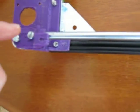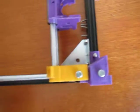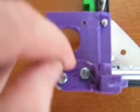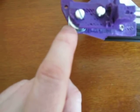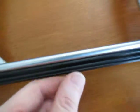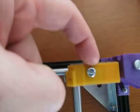There is just enough clearance for the belt to have one twist along its middle axis. If it happens to rub, I'll put the twist further along. Basically the belt comes around on smooth, then on teeth on this bearing — this is the one that if critical should be replaced with a GT2 idler bearing. Then a twist on the back here going around so that it goes on the smooth side, smooth side there, smooth side there. So it's smooth, smooth, smooth and the critical ones are this one here.